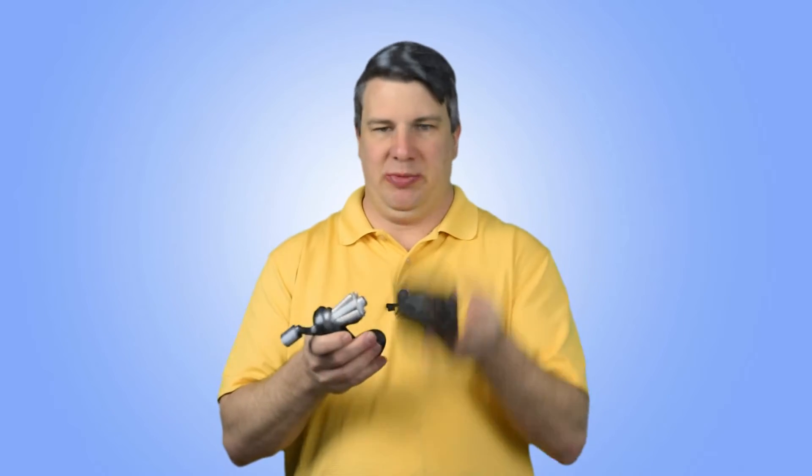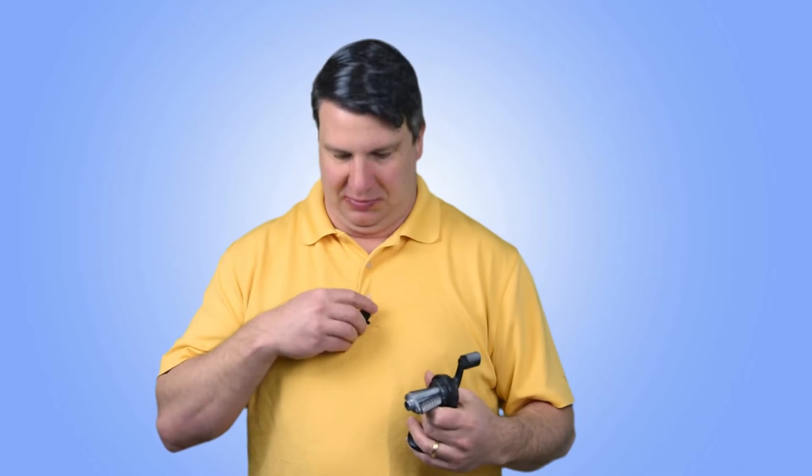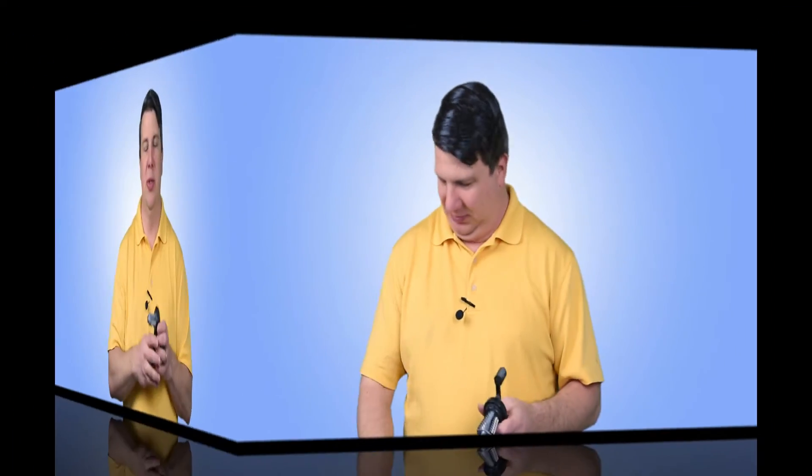The first thing you notice is that you have the arm mechanism connected right to the handle, so you're inputting on your arm. Your stationary part is going to be your ring gear, and there actually is no sun gear — there's no purpose for it anyway, especially when you want to get down to a fine point on your pencil. You really don't have the space for it, and as you can see here if you look closely, the two planetary gears are very close to each other.